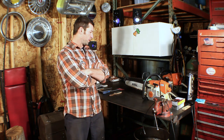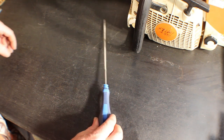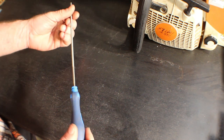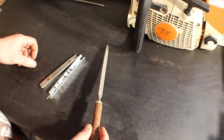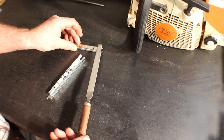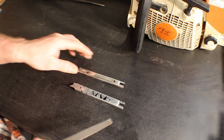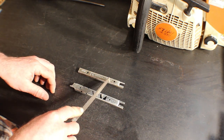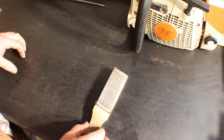Let's take a look at some of the tools that are needed, or are useful. At the absolute minimum you will have to have a round file with a file handle — the round file is what's going to be pressed through and file the metal away, sharpening your chain. Next up is a flat file along with a depth gauge. The flat file takes down your depth gauges, and the depth gauge tool gives you the proper height. I have two different depth gauges here: a 0.025 and a 0.030, so you get a bit deeper of a bite using one of these.